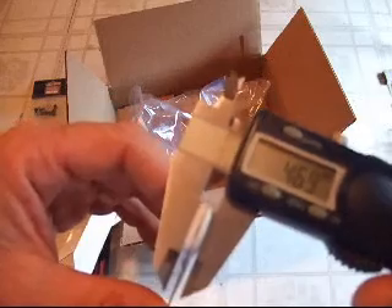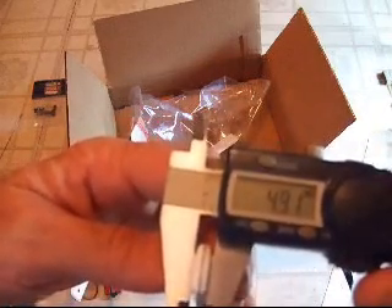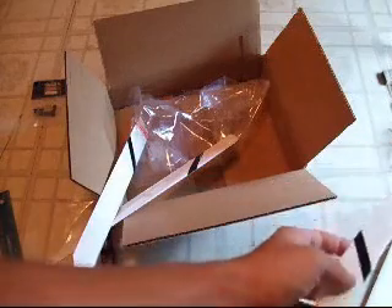This one was the 4.69, the one that I expected to be replaced. And this one was 4.91 and it's a five millimeter gap on the aluminum blade holder — so this is what all the blades should be. I wanted this one replaced. I told him to send me one if somebody measures it, or send me a pair to give me a better chance of getting a good one. Well, I didn't get a good one.